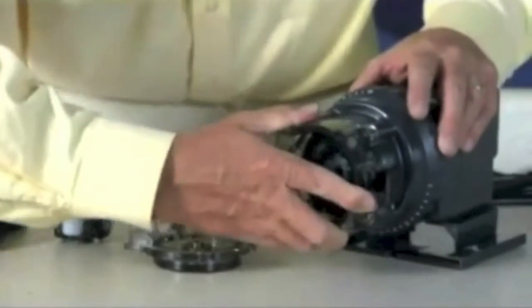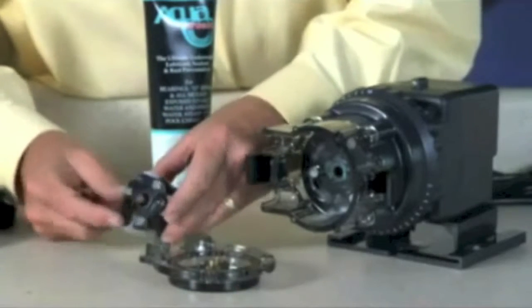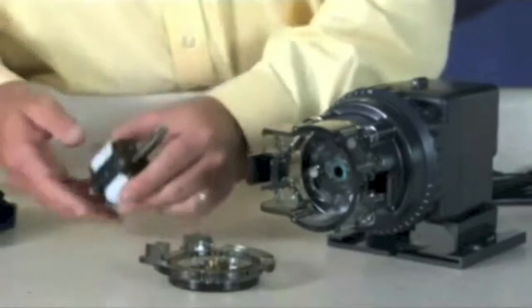Reinstall the clean tube housing. Apply AquaShield to the shaft tip. Install the roller assembly and shaft into the feed rate control.